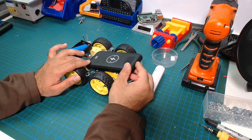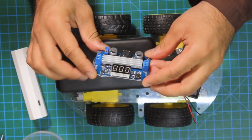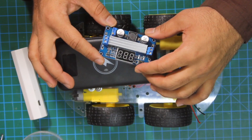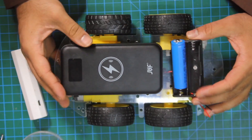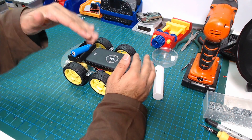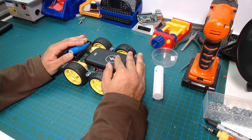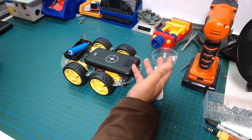We can use those batteries to power the motors and the power bank to power the Raspberry Pi. There is another option — we could use a booster, taking 5 volts up to 12 volts to supply both the motor and the Pi. But to avoid complications we are going to start off with two different power supplies. This whole level will be dedicated to power supplies. Once done, we will cover this layer and add the Raspberry Pi and Arduino, or sensors, on top. We can replace this with the booster module or find a better solution later.